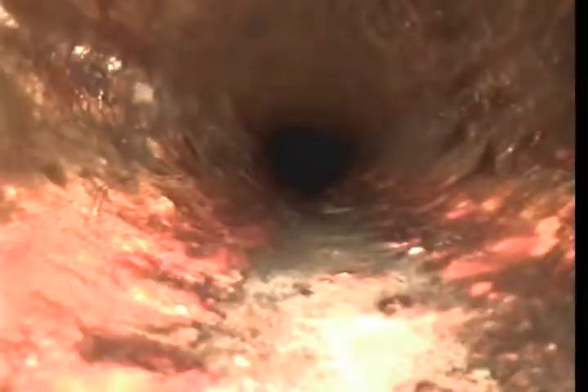Under the line at 27 feet nine inches, we're just going to go up to the 90-degree bend. That's the end of the line there. There's a tie-in there for the bathroom. Cast iron material, four inch. Actually the rust isn't too bad. This is what happens with cast iron material over time. I don't see any paper products hanging in the line, so that's a good sign. There's a little bit of a repair — it looks like there might have been a section that was bored through or rusted out.